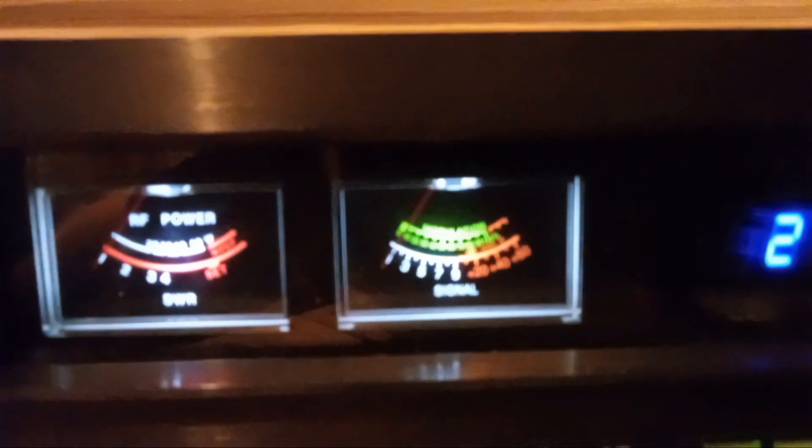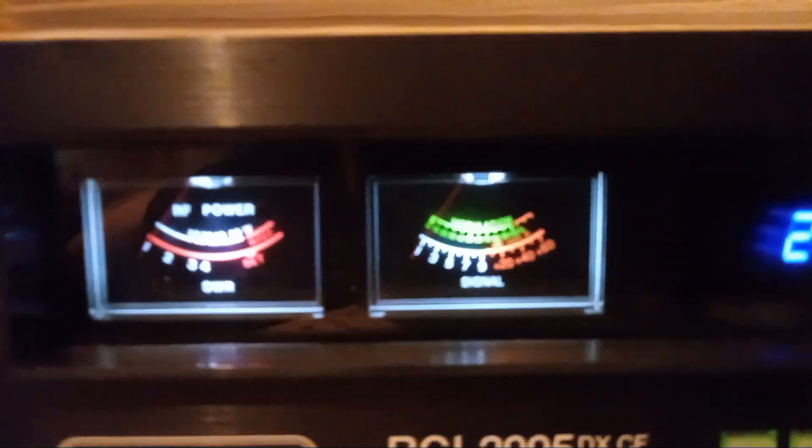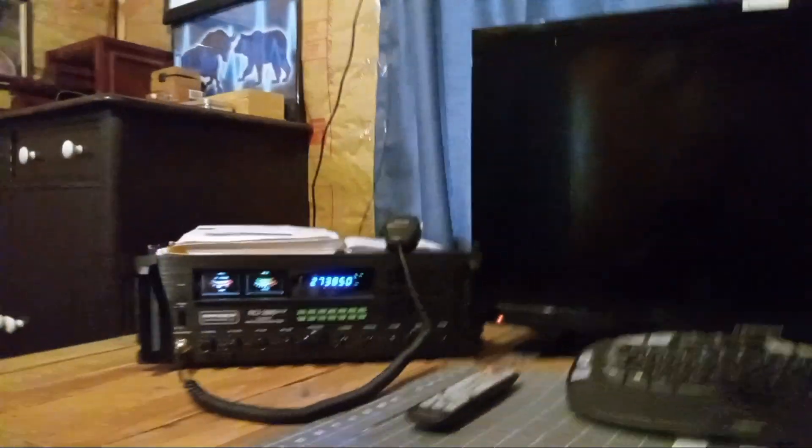The reason why I put that grounding bar in there is that these two monitors and my computer are throwing off so much RF. When I turn them on, the noise level goes up from practically zero or S1 up to S7 or S8 — that's how much noise is being transferred to the base station. Hopefully by grounding the chassis and all of these, I can get some of that RF to go to ground.